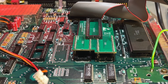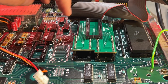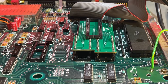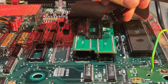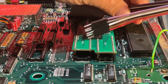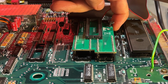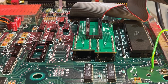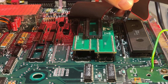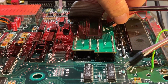So next step is to install the wires that goes from the contact to 3 different places on the PCB, the motherboard. So I was thinking maybe using these connectors, but yeah, I'm not really sure. Maybe I should rather solder bodge wires from the back side of the PCB instead. This will take a lot of room, and yeah, there's a possibility of bad contact.